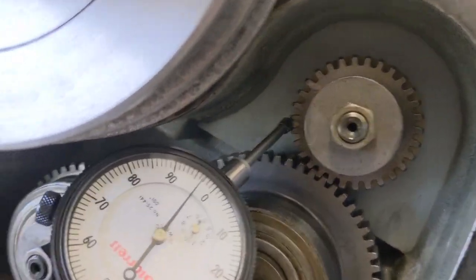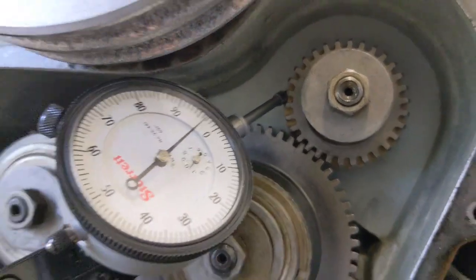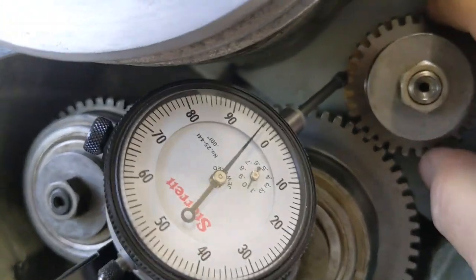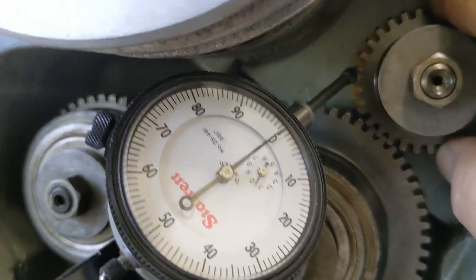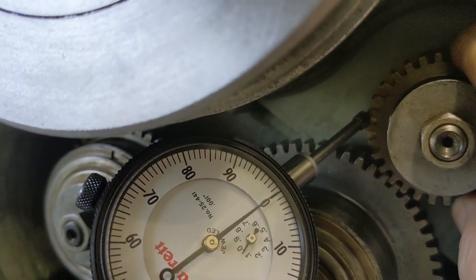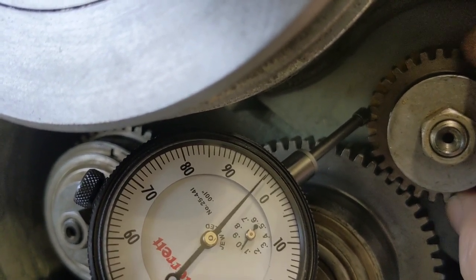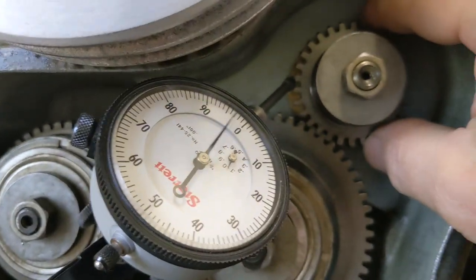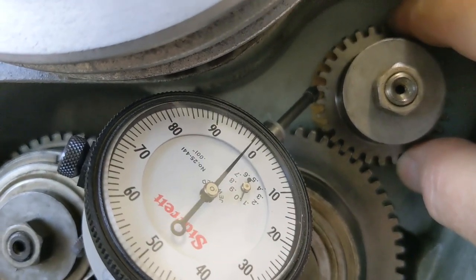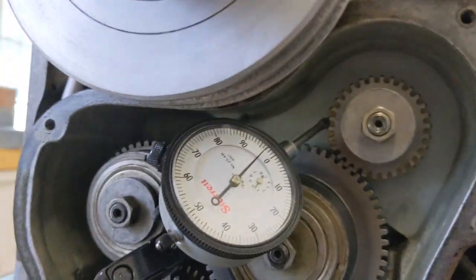So here's what I've got rigged up. Obviously I'm going to get an incorrect reading being at such a dramatic angle, but let me just show you — this is not any trickery. So my little wire works. There's zero, and just right around three. So I used that little three-thousandths wire to make that adjustment, and that's one, two, three. So that actually turned out pretty well.